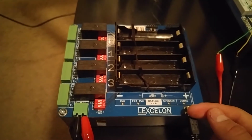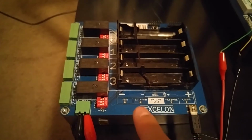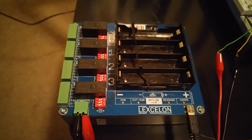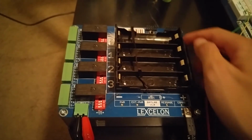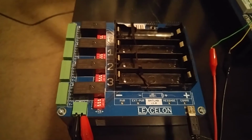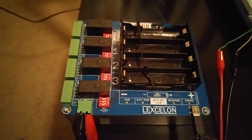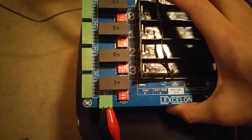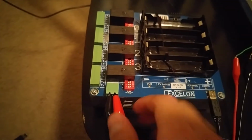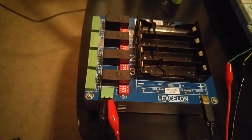So this is for transferring the information from the device to the computer, but also to power the measurement and communications processors that drive some of these LEDs that you see on the PCB. The discharge and impedance functions of this device can be leveraged just by the USB power connection. However, if you want to use some of the charging features, then you will have to apply additional power via the 5-volt external power supply input. So that's what you see connected with these alligator clips for demonstration of the LEDs at a later point.